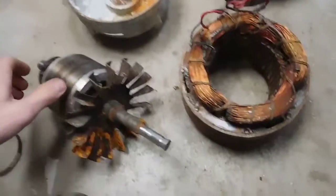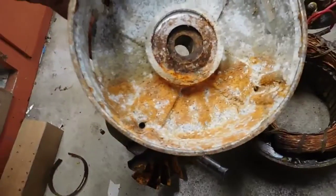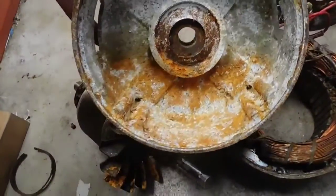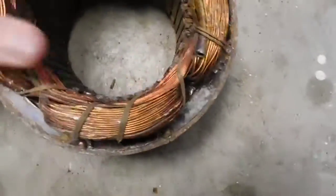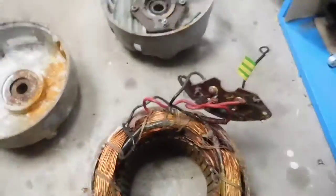Eventually managed to get the rotor out via a lot of hammering with a block of wood. I can basically conclude that it's had water in it — quite a lot of it at some point in its life. As you can see by that tide mark on the front end bell, it's basically rusted everything that's been in it, including the rotor's cooling fan and the actual rotor itself. The stator has a lot of wear on it, even inside. It's not too bad up the top there, but it still needs a really good clean-up — a lot of that rust residue has got to come off. The back housing is alright, but as you can see down the bottom, where water's been present, it's taken its toll.